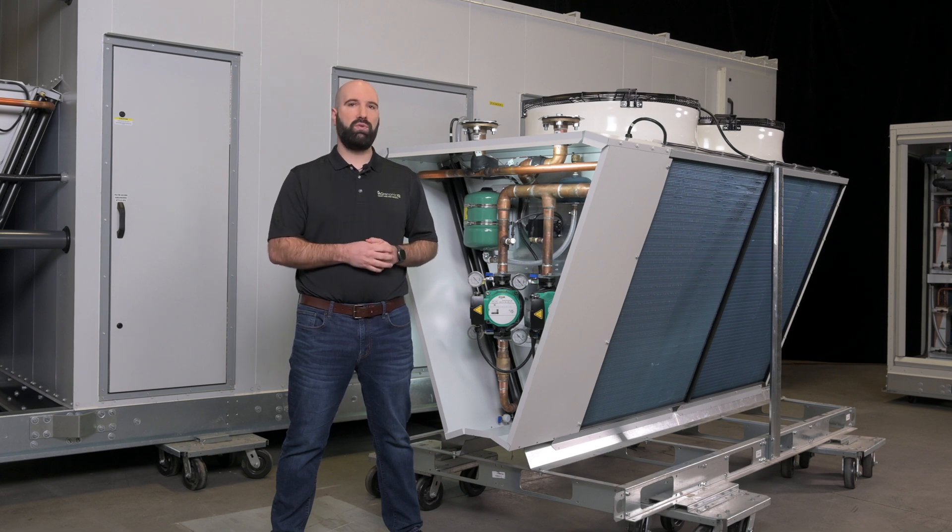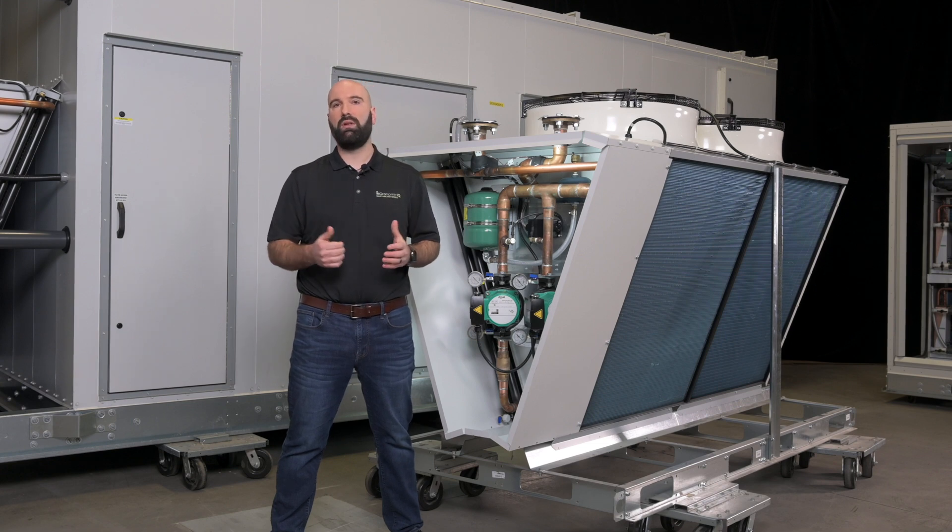So in a 6V dry cooler, you have 12 independent pumps and 12 independent fans, and any individual failure doesn't affect the balance of the operation of that dry cooler from an operability or redundancy perspective. They're designed very specifically that way.